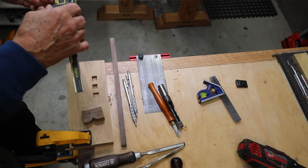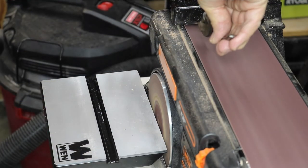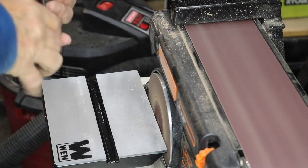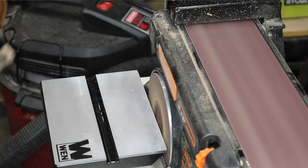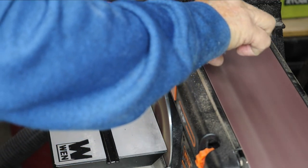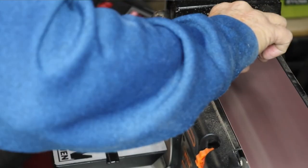I check the depth of my holes with calipers, because that allows me to cut off my pyramid plugs at just the right height. At this point the plug should be too large for your holes, so I taper the bottom edges all around. I do that using a set of pliers, because a small piece like this will catch and go flying across the room if you try to hold it freehand. I've got it tapered all around the side.